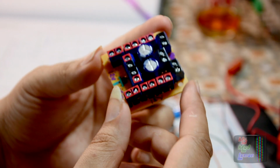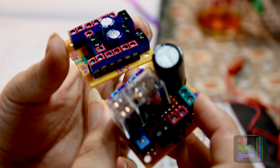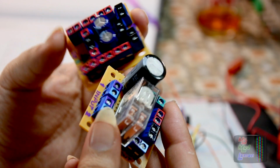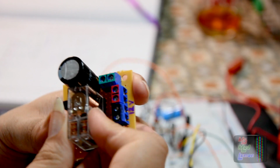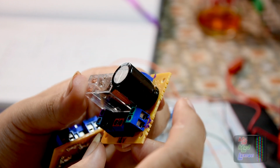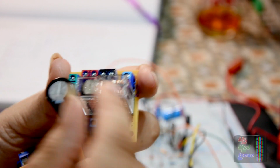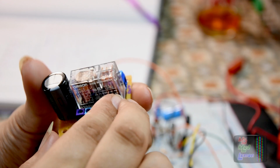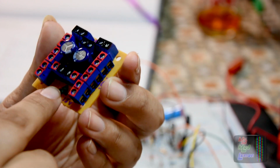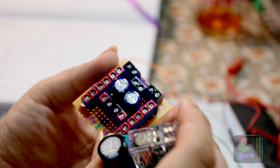So this circuit here, I built a couple of things which I haven't documented or made videos on, because you've seen essentially the same thing that we built before. This is the input switcher. You put the voltage here, and that's the switch. You have input 1, input 2, and this relay switches between them, so it's the aux and the SIDBox inputs. And this is just like a voltage multiplier kind of thing. So it's 12 volts in, and all this becomes 12 volts. 15 volts in here, all this becomes 15 volts. So, yeah, the simple things that I need to show.